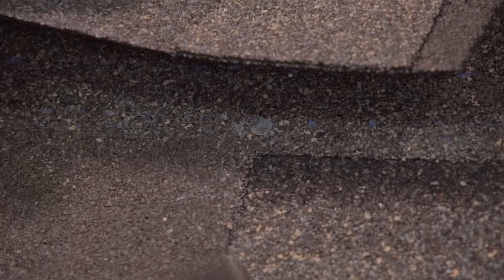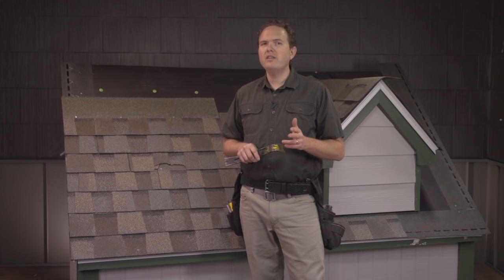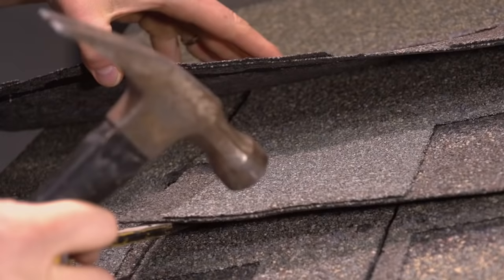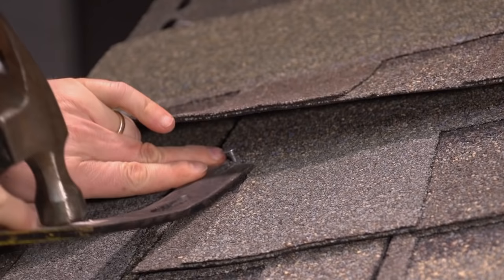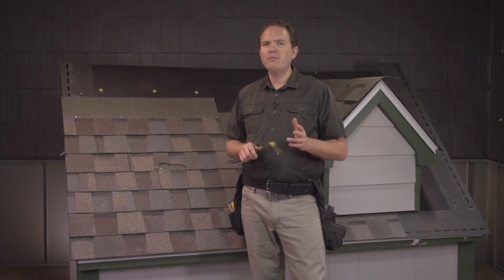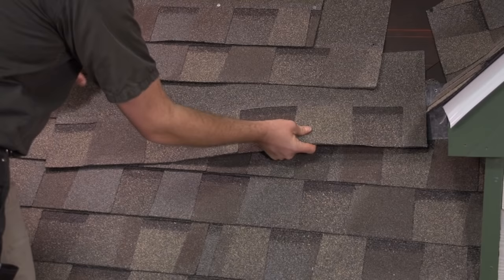Give the shingle a tug. If it doesn't slide out, you'll need to go up to the next shingle and remove those nails too. This is good because it means your shingles are nailed in properly. If the person who installed your roof nailed the shingles down incorrectly and the nails are too high, they won't be holding the bottom shingle down. So next you'll need to remove the nails in the next shingle up — these nails are going to be going through the top of the shingle you're trying to remove. Give it a tug and the shingles should slide out after you've removed all the nails. If it doesn't, don't force it as you might end up damaging one of the shingles that you want to leave.